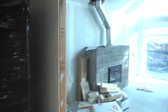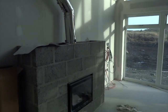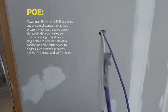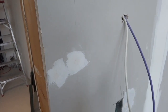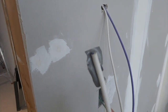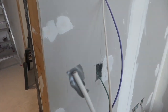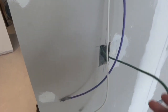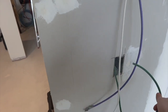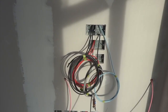The next place we have is the main living room. This is a double-height vaulted ceiling up here. We've got a wood burner stove. To the left as you come in, we've got pre-wire for any PoE touch panel system that might change or be added in the future. We've got a power cable. What we're doing in this particular instance is installing some iPad minis using launch port — so there'll be one here for control of music or lighting from the tablet. There's also green for audio control, though this will actually be left for future and mudded over.